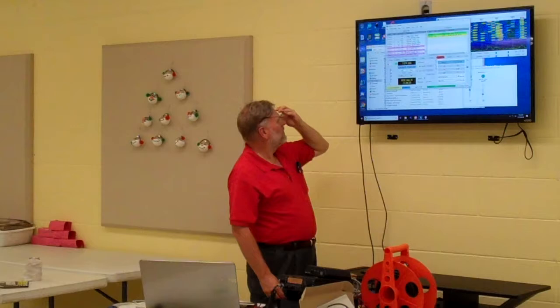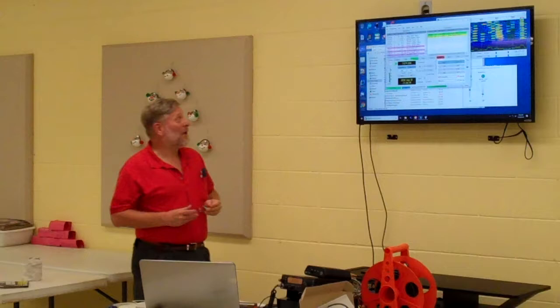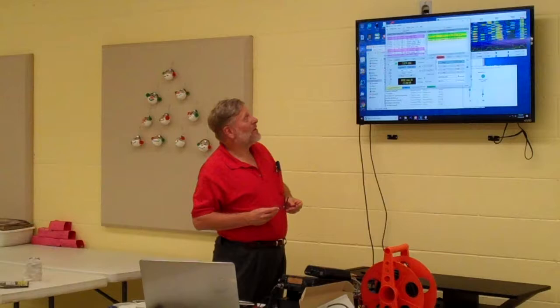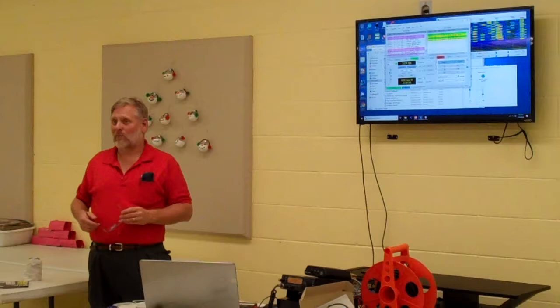And he's pretty loud. The signal reports are in decibels based on a signal to noise level. +2 is like S9, +10 on your meter. You'll see some other signals. I just saw a negative 16 here from W1HS. Negative 16 is really, really low. When you get to negative 20 to negative 24, you probably can't even hear the signal in the noise, but the sound card is actually still decoding a signal.